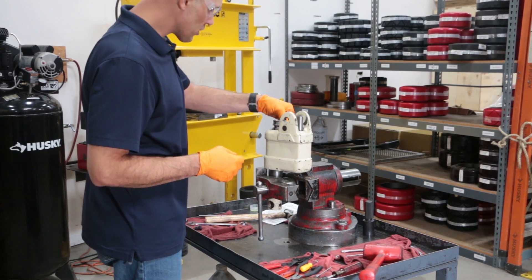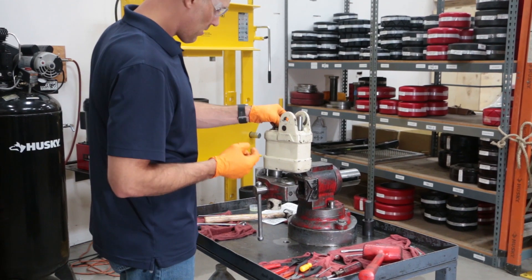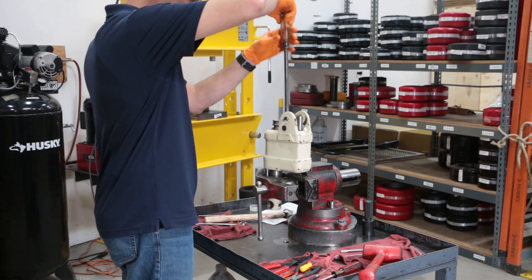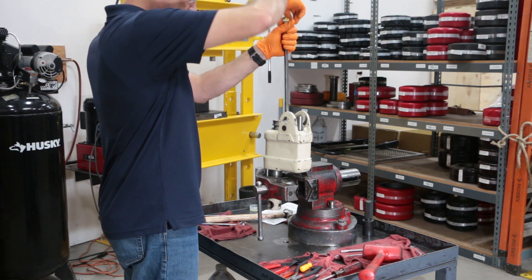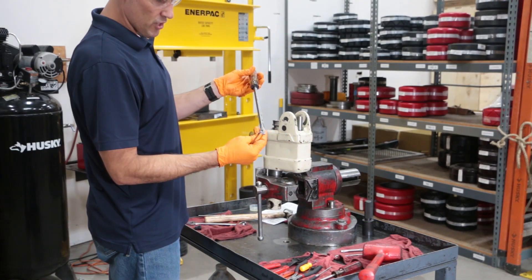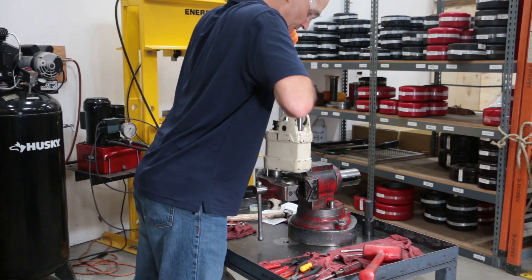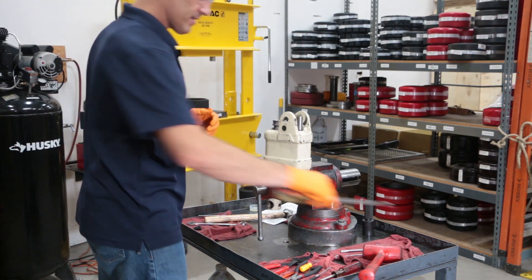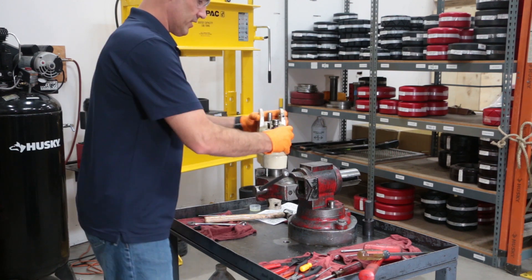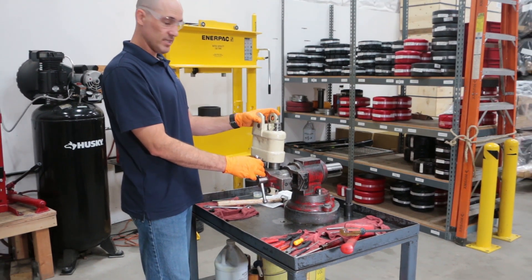Take the small copper washer and the oil fill plug. For tightening the fill plug, I like to use a square stock screwdriver with a wrench attached to the edge to give a little more leverage to get it a bit tighter than you would with your hands. That is it — the unit is rebuilt and ready to install the handle and attach it to the jack. For bleeding tips and handle installation, please see our website.